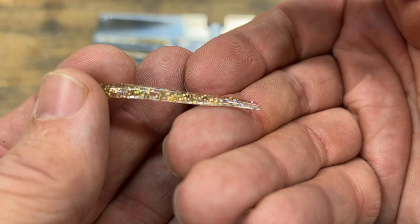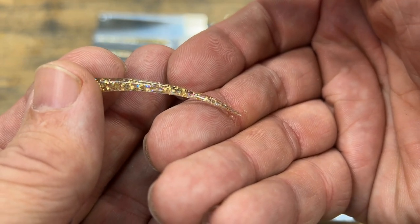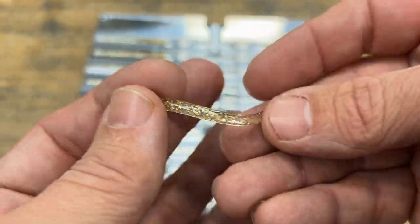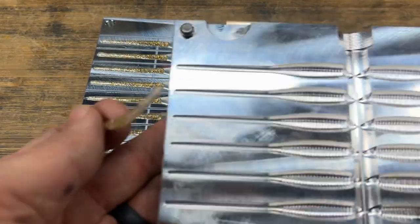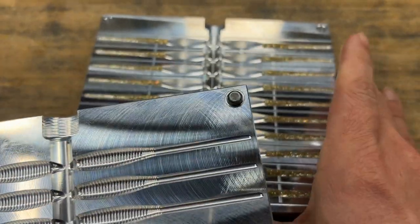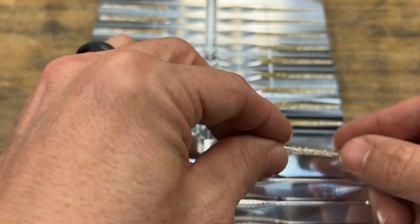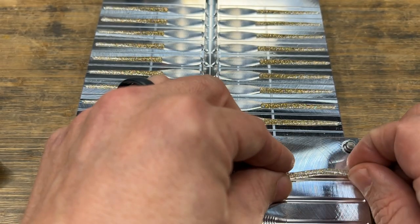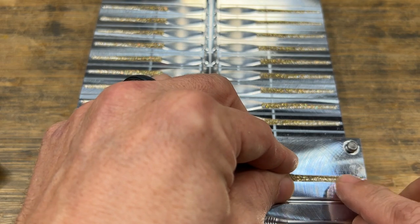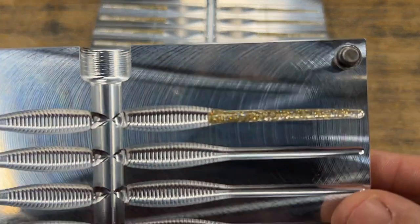There's a design to this tail where it's flat on one side, so it's not perfectly round all the way around, and that's key to getting it in the mold properly. You see the taper — it's wider one way than the other. So as it goes in the mold, you want to put it wide side down and get that tail right to the back, just like so.